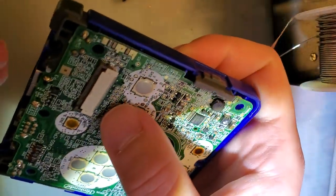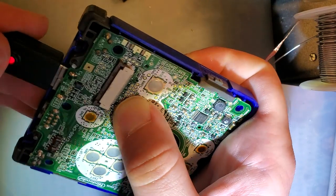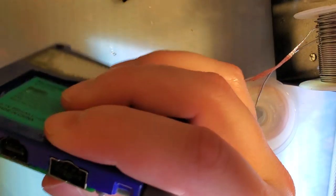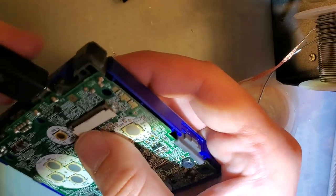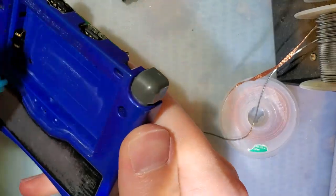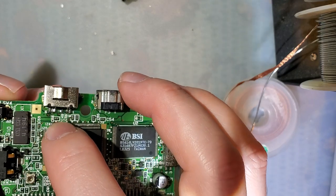And, kill that light so you can see a little bit better. Thing's still plugged in. It does not charge. So I'm thinking I don't have a good ground connection. Oh, what the heck? There's an extra pin in there. I didn't even check that until now. All right, so no amount of wiggling is getting it. Ooh. See, that's what I was afraid of when I noticed I wasn't getting that ground reading. It should be on this pin here, number 6.